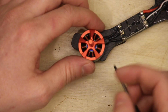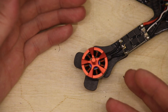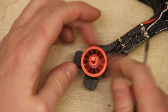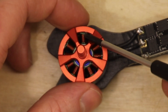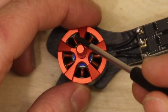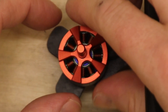It has to be some sort of sine wave — that's how you control it. And the technology in this motor is the same you'll find in an electric car, an electric kick scooter, or a drill — anything that's turning around like this. If you put power into these windings, you create a magnetic field. So you'd have the north pole here and the south pole on the other side, and then it changes to the next one, continuing north pole, north pole, south pole, south pole.